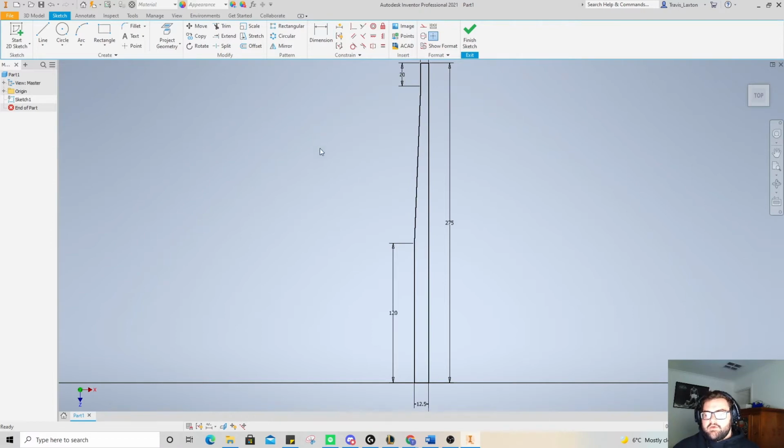Cool. And we're going to leave that like that. No, we're not actually. Because you will notice on that drawing that we have a 15 millimeter hole in the back end of it. This is actually incorrect. It's a big hole that takes out a lot of weight of the hammer, but it doesn't actually serve much more of a function rather than take the weight out of the end of it, so it's a bit nicer to swing. So what I'd actually like to do, if we can take some of the weight out of the handle, and also have a screw in another face for the soft face hammer, is probably a lot better of an idea. So this hole is going to have to be 12 millimeters big.